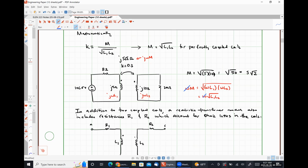So we're going to get the same exact results if we just use the reactance part of the impedance, meaning we throw away the J. We would get the exact same results doing that as if we had access to the nominal value of the inductances measured in henries. So I was playing fast and loose. Yeah, it's exactly right.